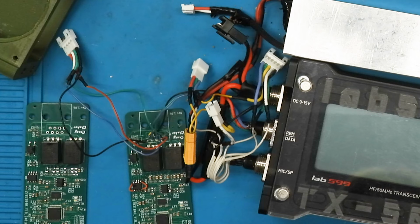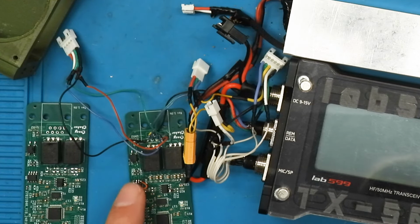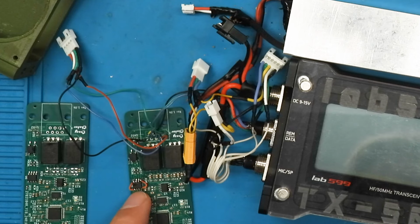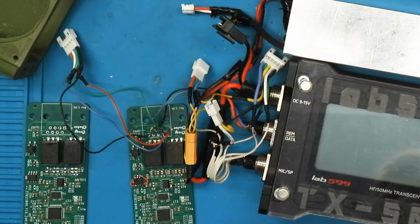So this is not really separated anymore, but I cannot separate it if they do not give me the voltage. I think there is a way to separate it. There exist some other integrated circuits that can do this, but I don't know them. This is a standard chip, but it needs a voltage from the other side, of course. It can also transform the voltage from, I don't know, 3.3 volt on this side to 5 volt or something else. Also level shift.